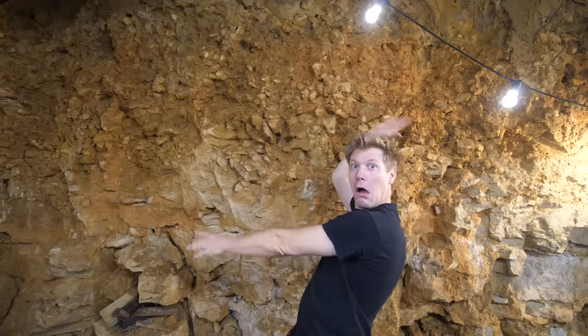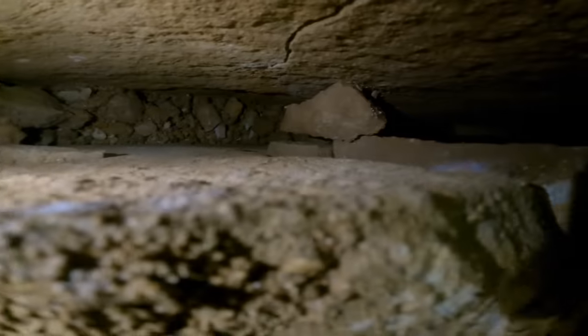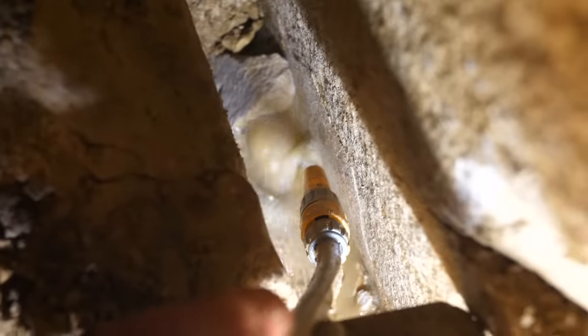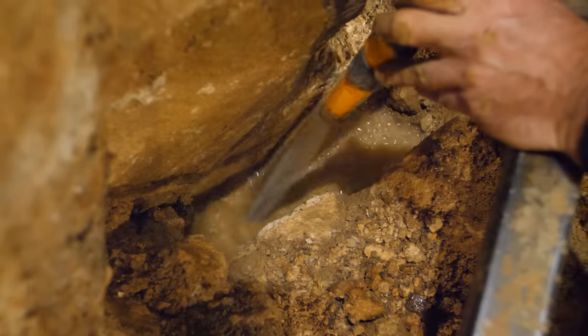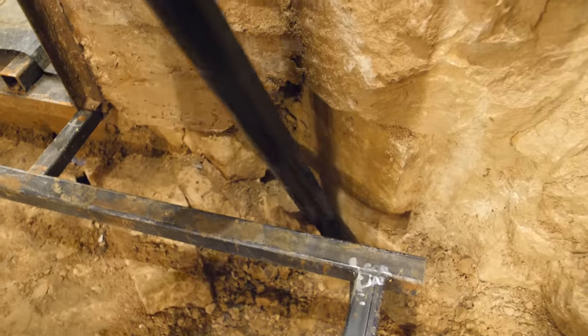Before we put any plate walls up we've got something to consider. Where I'm standing is where the soakway used to be for the house and the drive - and of course there is still going to be a drive above me, it's going to rain, and that water needs to go somewhere. The cracks in the rock go on for the whole rock section; you can stick a hose pipe down them and run it and it does not fill up. So we've cleaned one out, stuck a bit of drain pipe down into the crack and put it up against the wall to connect onto later.